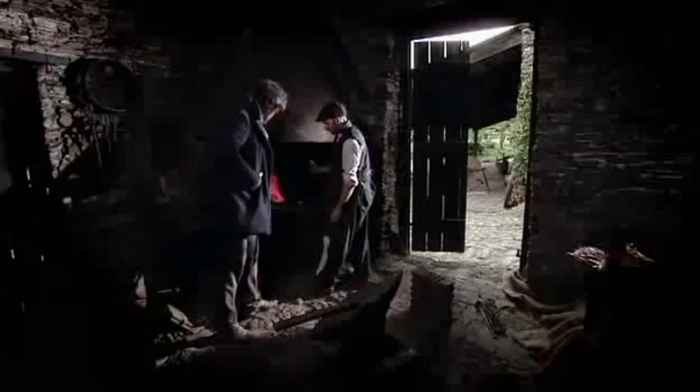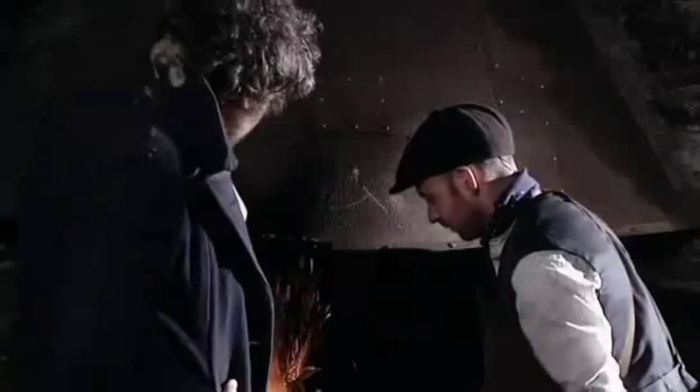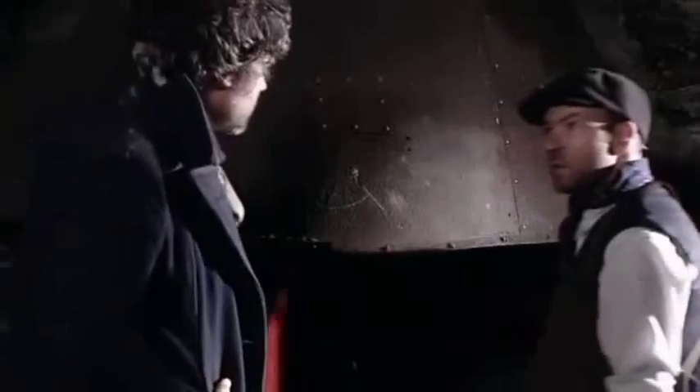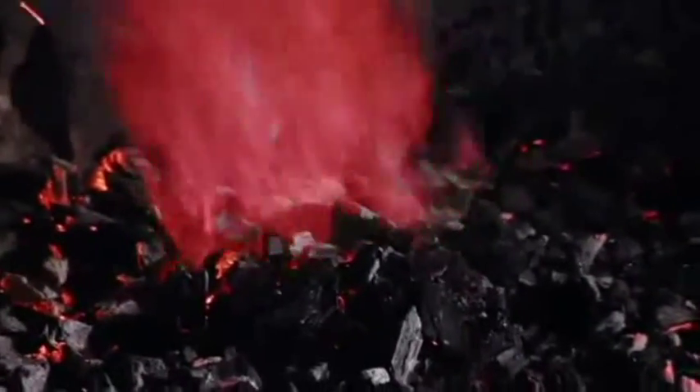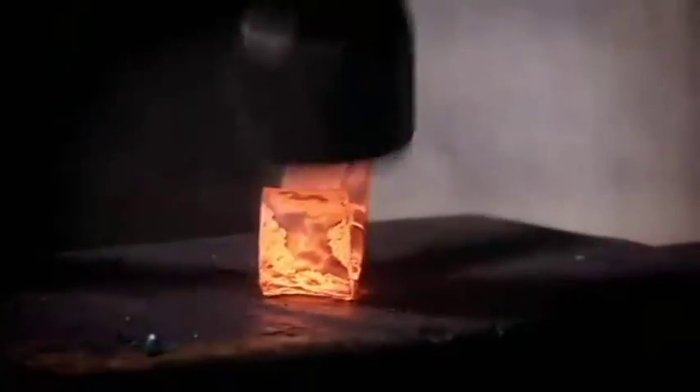The charcoal is doing really well — we're getting the heat quick in there. We've had to break the charcoal down quite a bit because it's in big chunks. Charcoal is very good for working metal — you don't need as much air going into the fire as you do for coal or coke, but you can get the heat in very quickly. Now we've just got to get on with the scroll — we start to curve it off the edge of the anvil, brushing it gently with a hammer, just gently brushing it down. Then knocking it towards me, and then just gently elevate.